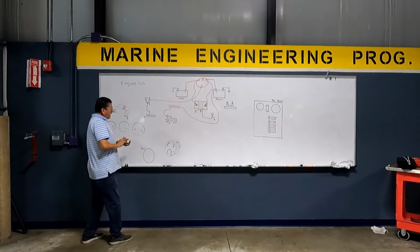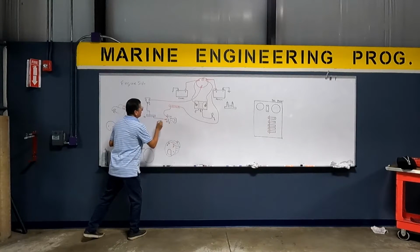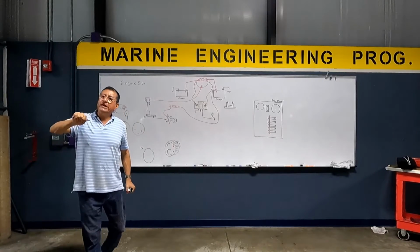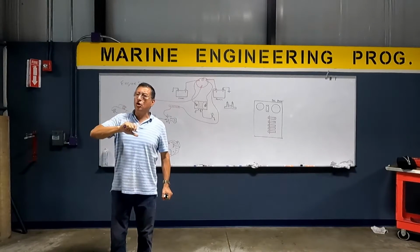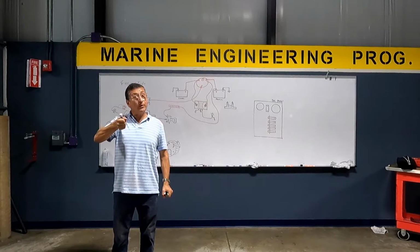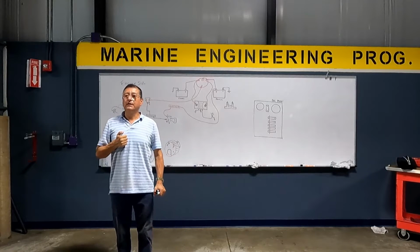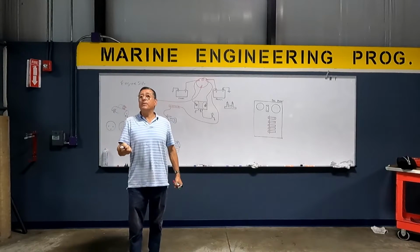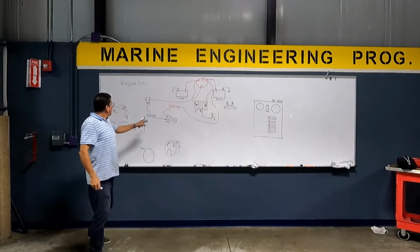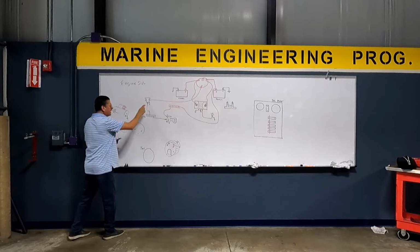Okay, now I am going to connect, of course, the ignition bus bar directly here in the position ignition. Excuse me, the position ignition in the ignition switch is permanent or temporary? It's permanent. It's the number one, the first one. The second one is momentary. Turn on your car and everything lights up. Good? All right.